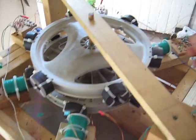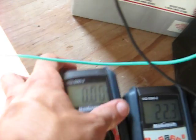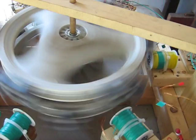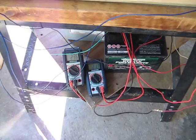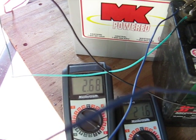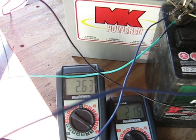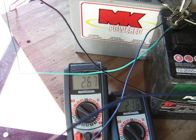18 more coils and she'll be humming. It already burns my hand to put friction on it when it's running — within a second it burns my hand. My run batteries are two deep cycle 12-volts that are hurting right now, at 22.3 volts. Here I have my amp draw we can look at. I'm going to give her a spin. You can hear it pumping those coils on the magnets. That's going to settle right there at about 2.7, 2.73 somewhere around there.